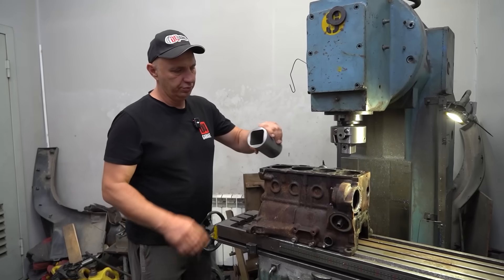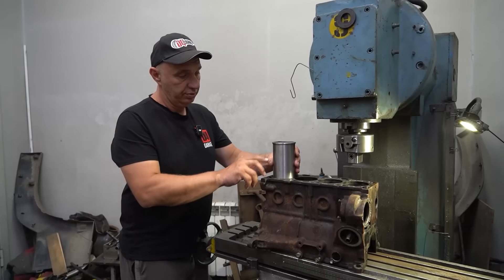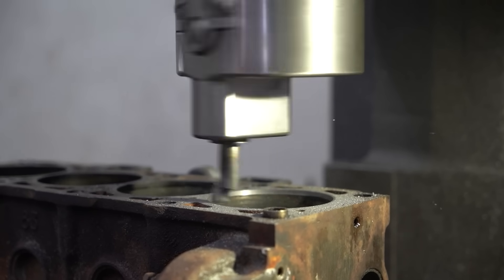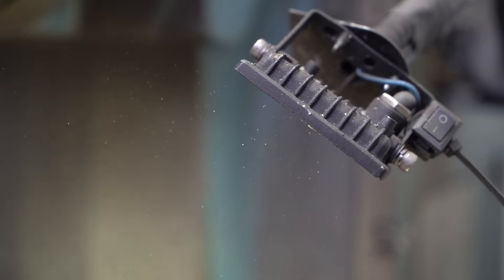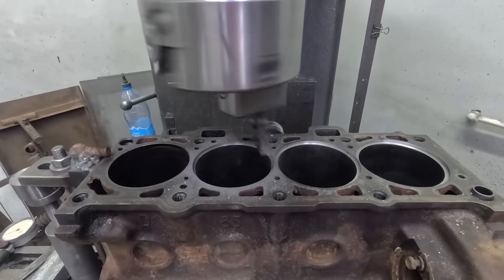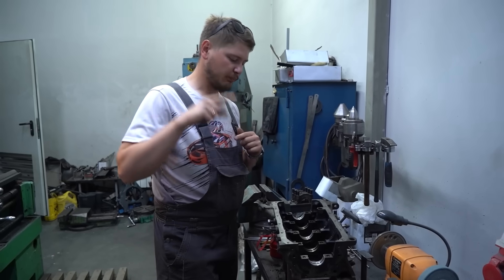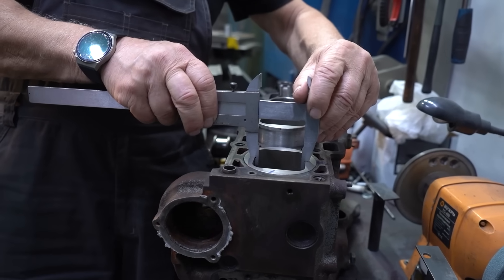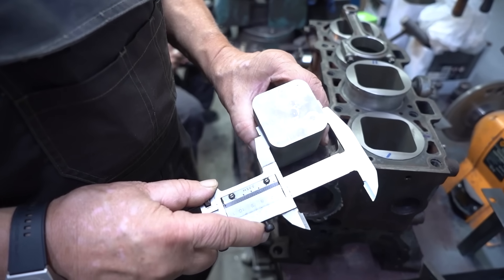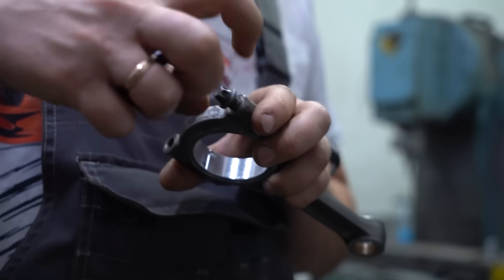Here's what makes this a bit of a headache — all of these need to be even relative to each other, so we are having to machine the sleeves as well as the block. We are going to slip them in without using a press. The upper bit is going to be overboard, so we'll place them in — it will sort of be like on a Volga motor; the idea is to sandwich them in. We've done all the measurements associated with the rod and piston stroke, and now we need to measure the distance between the center of the pin and the deck to find out where we need to cut the hole for the pin inside our square section piston. We install the crankshaft with one rod fitted and then we measure.